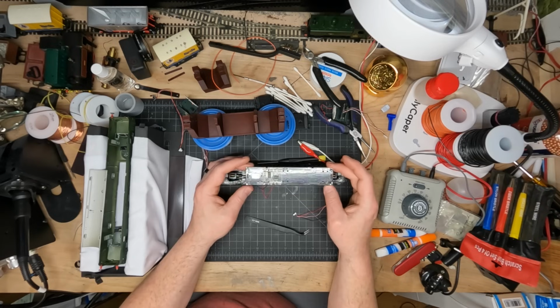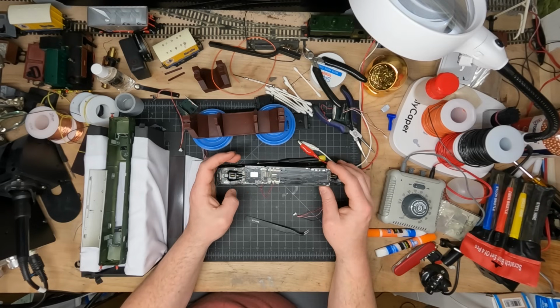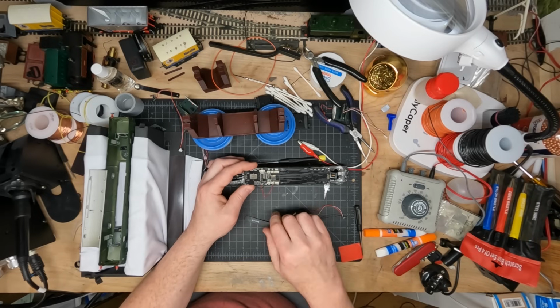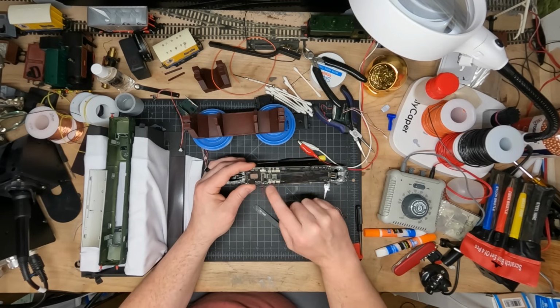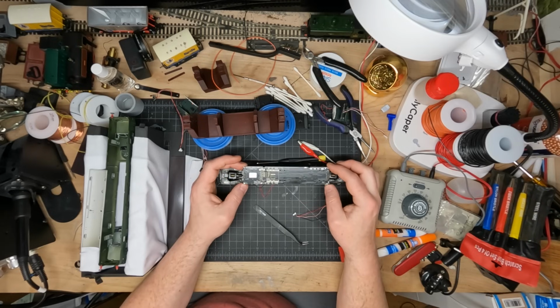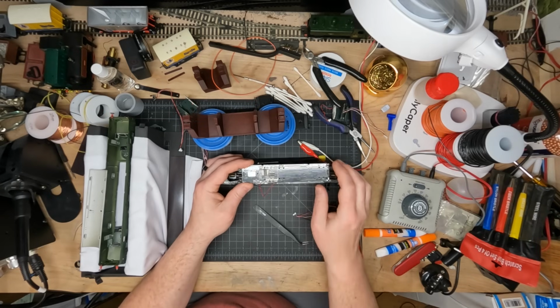You have 4 wires, 2 each soldered to the corners here, and that are from each bogey, and then there's a black wire and a red wire that go to the motor themselves. All you need to power the motor is the blanking plate and the wires here connecting the pickups, and then these 2 wires here connecting to the motor.